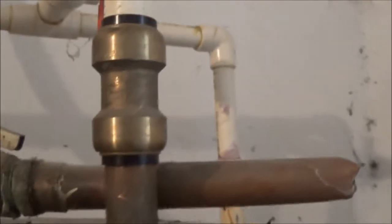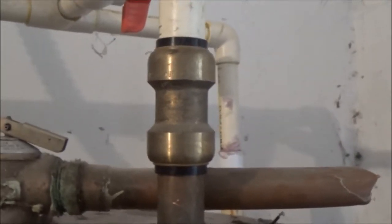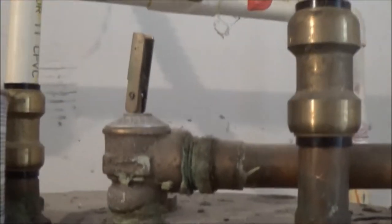It may be plugged up so much it's not going to want to drain. I see a little bit of leakage, so it's going to take a few minutes — I'll let it drain and be back with you. Also, you're going to want to open a hot water valve somewhere in the house, like the hot water in your sink, to let air into the tank. Or you can use the emergency relief valve. Make sure when you go to fill it back up that you turn that back off.